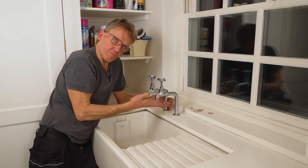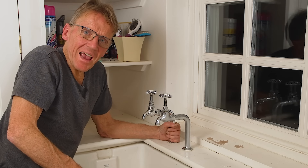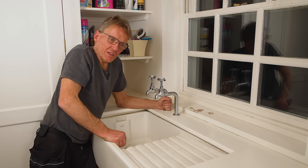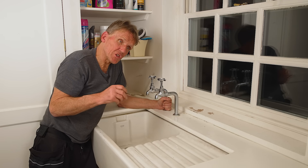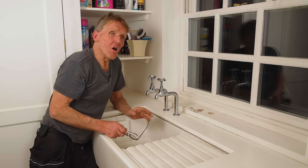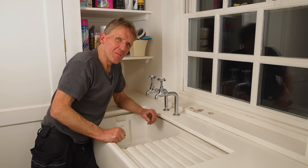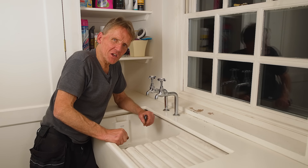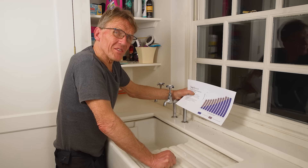The flow switch knows when it's turned off. So you could use this if you had a slow-filling tank, or a slow-filling toilet — and the great thing there is if you've got one loo in the house and several people using it, and people are sitting there waiting for the system to fill up before they can flush, then this is a great little thing because it will speed up the filling of that toilet cistern.